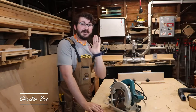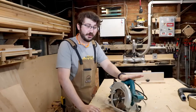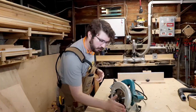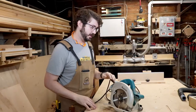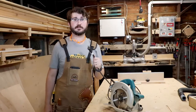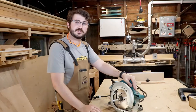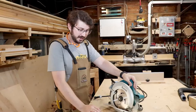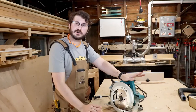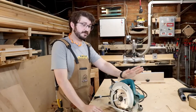This is one of those must-have tools — its specialty is straight cuts. You can use one of those squares to line up a line, clamp a board to both ends, and run it along the straight edge. It's a very versatile and cheap tool — this Makita corded one was about $80. The only thing to worry about with a circular saw is that it's much more dangerous than a jigsaw — the blade spins very fast. But with enough skill and practice, a circular saw is a must-have if you're looking to make straight cuts fairly quickly and repeatably.